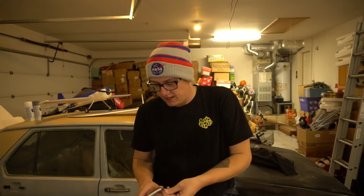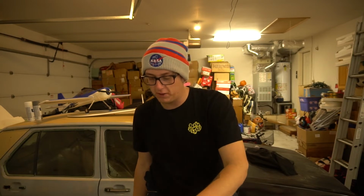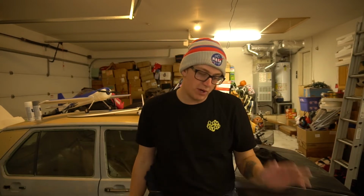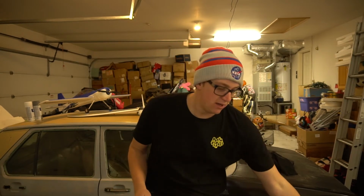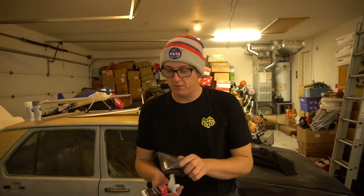Like I said, the logical next step is to spray it with primer and see where we need filler. But I kind of go straight to the filler first. And what I do, you can look closely at your fillets, and shiny spots are an easy telltale of spots that you missed or that are lower because there's still epoxy there. But the way I do it is a little different. I just basically create a whole new set of fillets on top of the fillets using Bondo spot putty.